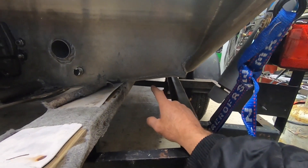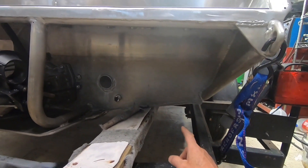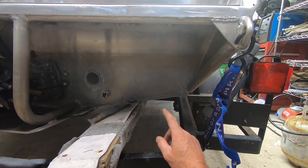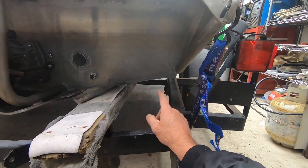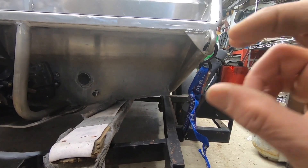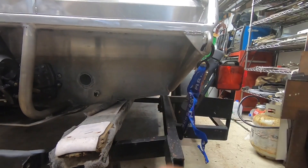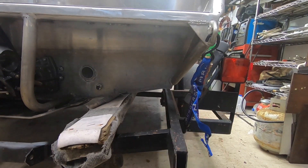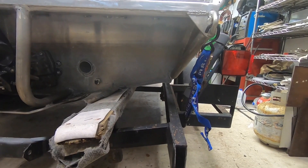The way I wanted to install it was to put thick beads of rain sealant, just like you do with UHMW, set the metal on it, let it cure, and then weld to secure it. I figured I'd have some plug welds through the metal, and then weld on the edges — maybe add a piece of metal to combine the two. But I want a gap of cushion with the sealant because it doesn't cure rock hard — it has some give. So you'd have an extra layer of metal, and the chances of going through to the inner hull are pretty slim.